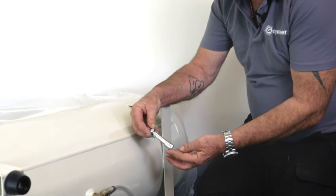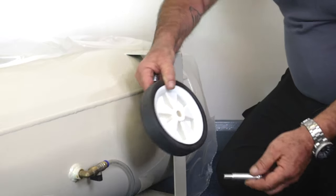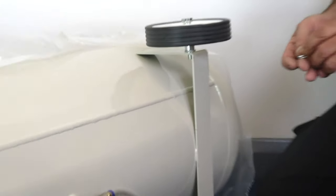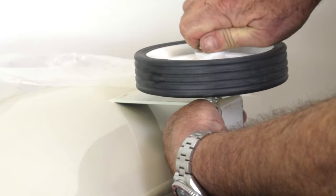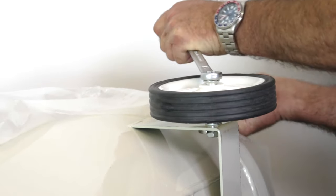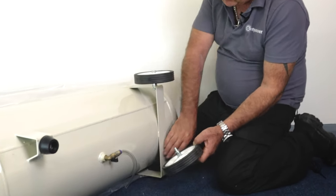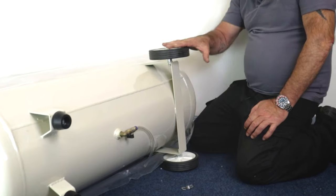Taking the larger bolts, you can see it's pre-assembled. Take the nut off, spring washer, two washers and the spacer tube. It doesn't matter which way round the wheels go — they're the same both sides. Fit the bolt, then the spacer, the wide spacer, then one of the flat washers, and pop it in the hole on the machine. Next, put a washer on, spring washer, then the nut, and loosely fasten. Use the 17mm spanner on the inside and one on the outside and tighten the bolt into place. When correct, you'll see a little bit of float on the wheel — that aids turning and stops it stiffening right up, and is designed in. Repeat the same assembly on the other side, pop it in the hole, put the nut and washers on, and tighten up.